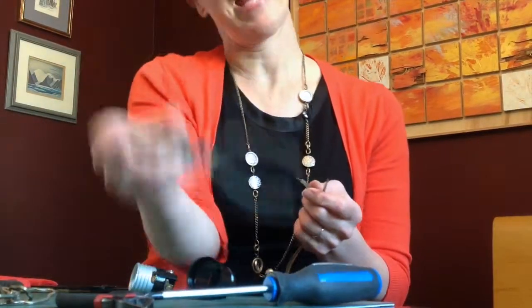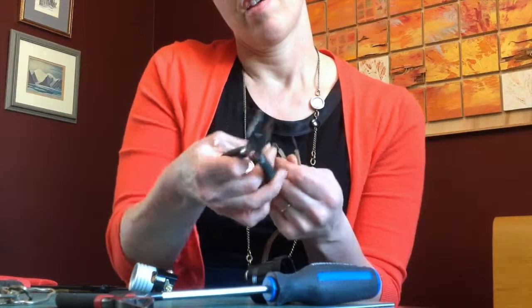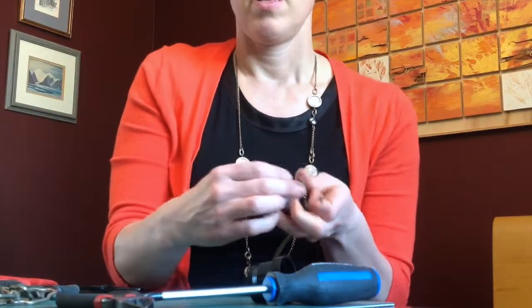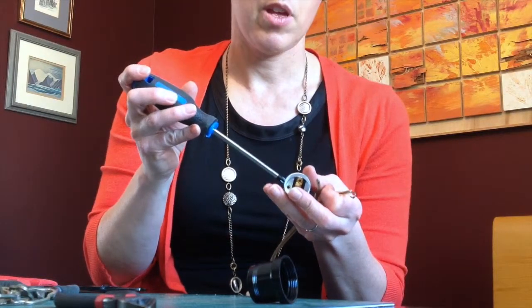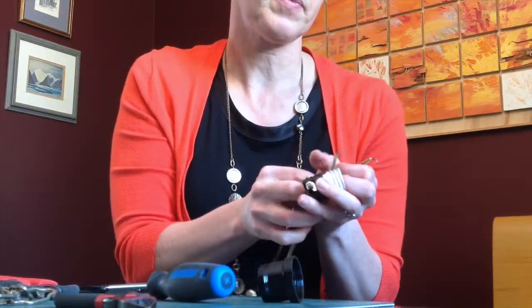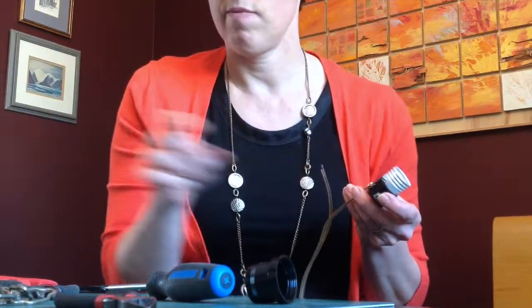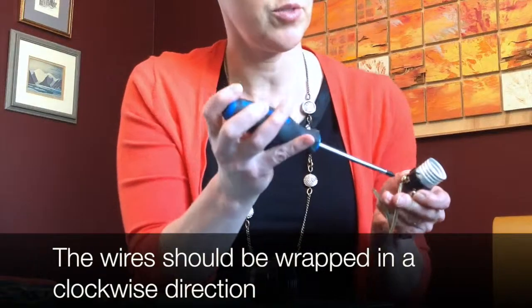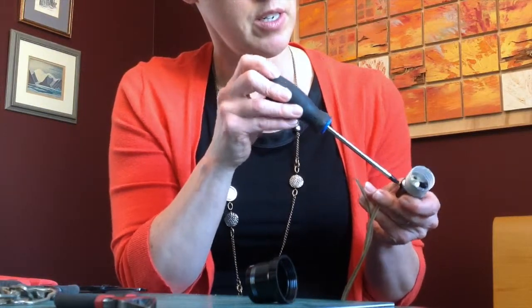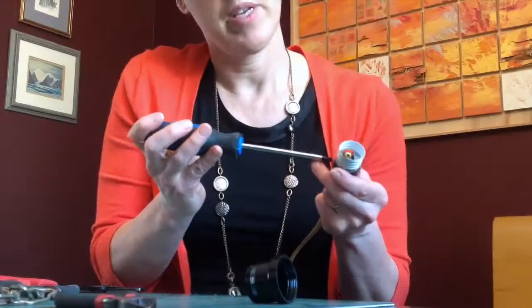This is where I get my needle nose pliers and make a nice little J-hook on the end of each wire. Then I get my Phillips screwdriver and loosen each of the screws — it's really simple. You'll want your hook to wrap in a clockwise direction so that when you tighten the screw you're actually pulling the wire into that rotation. Make sure they're good and snug.